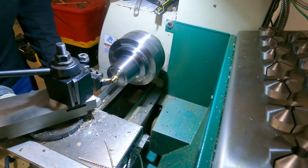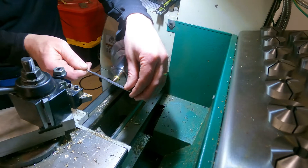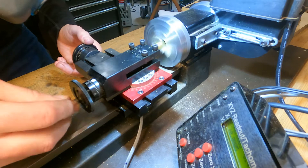You want this really thin because it's got to be a kind of a spring fit that's going to go on that shaft. For the final cut, put a little bit of lubricant to get yourself a nice clean cut in there. Then I clean that up with a good file that I use just for brass. You can see what I'm doing now is parting this part off, and I want to get it over to my other lathe.